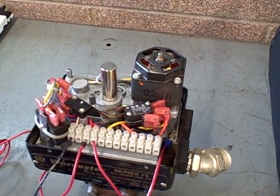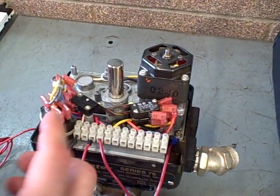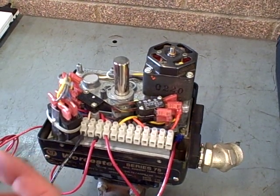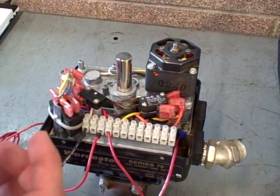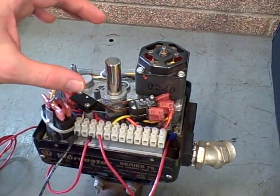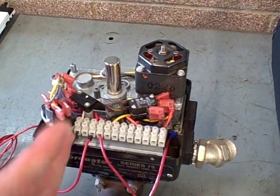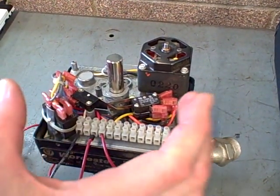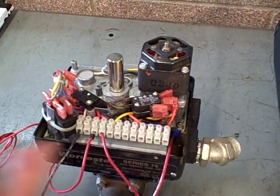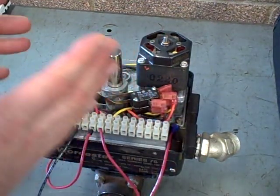They also have MOVs with electronic style limit switches that are not strictly mechanical. They might use counters like encoders to look at the valve position very precisely. Some MOVs have a potentiometer or an LVDT or some other sensor that's able to give an analog reading of that valve's position. Using that kind of mechanism with the appropriate servo circuitry, you can get the valve to proportion — so you could send it a 4 to 20 milliamp signal and have it proportion itself according to that analog signal.